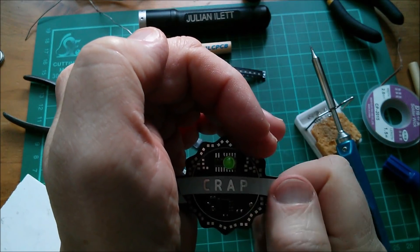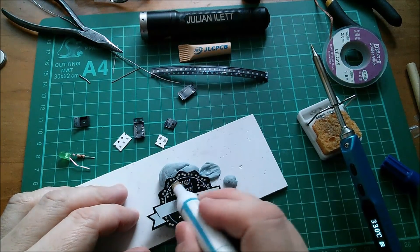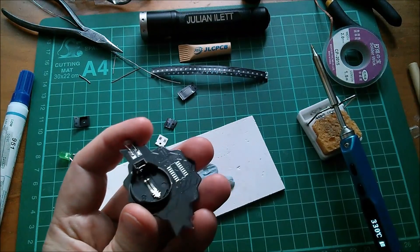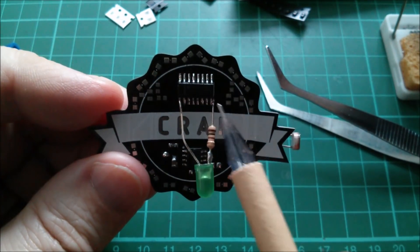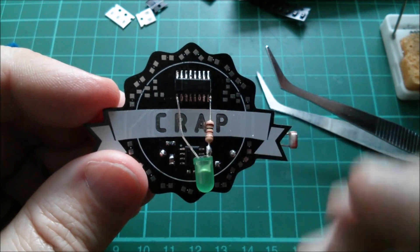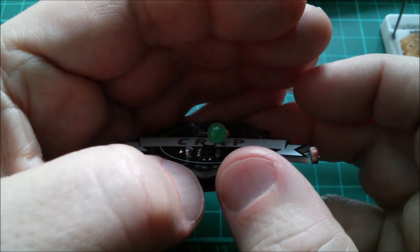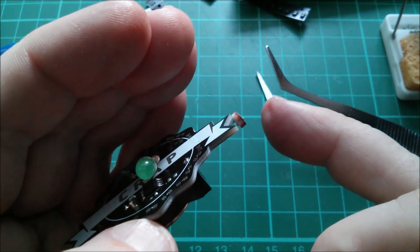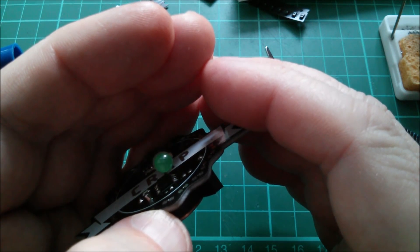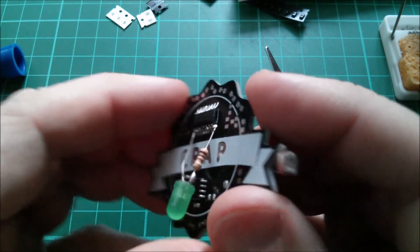3 volts should be really bright on a green LED - I'm not sure about that. Let me apply some flux and get the 4017 soldered on. Once I got the 4017 on, I noticed pin 1 is one of the 10 outputs and 8 is ground - and we've got a flashing on the LED, a fair bit brighter than before. It's being affected by the LDR - it's only a 1 in 10 flash, but if I cover it up it's much slower and a longer pulse because the clock has slowed down. That all looks pretty promising - time to get the other chip on.